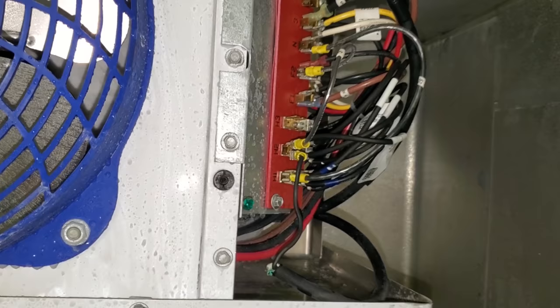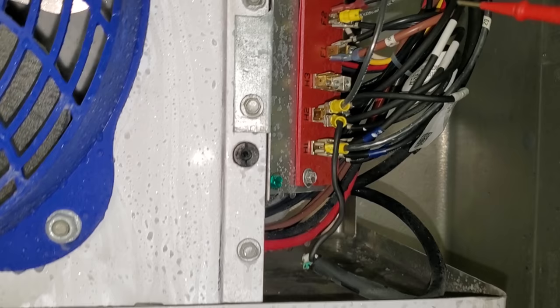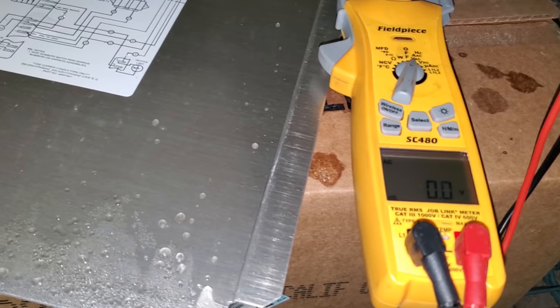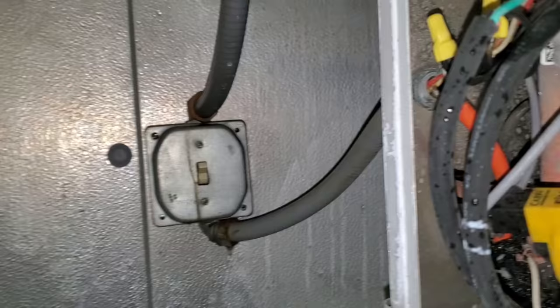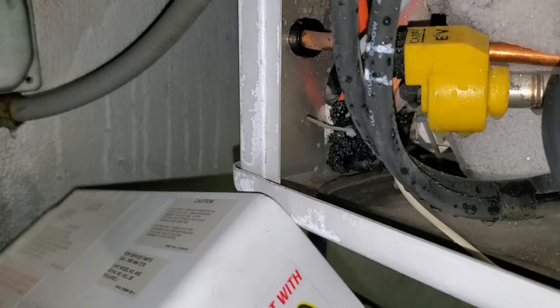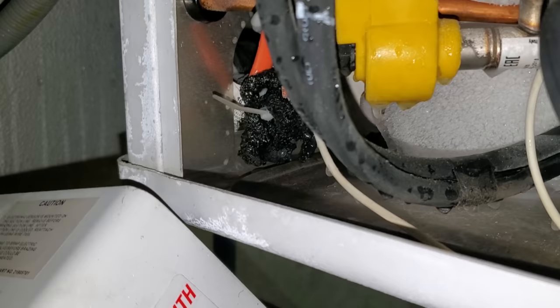Let's go between H2 and J. I jumped between F2 because that's where there's a jumper. We have no voltage - there's no voltage coming into this coil. We need to look over at that switch. I feel actuation, but it's not doing anything. I wonder if I need to get rid of this ice - maybe we've got a broken wire behind the ice. It's interesting.